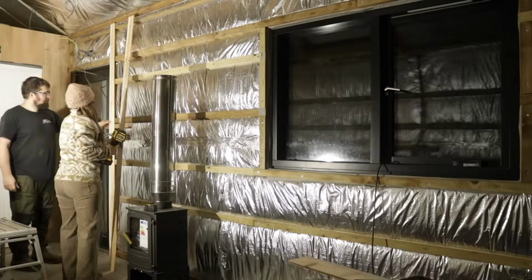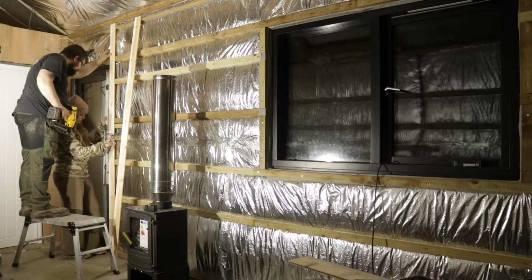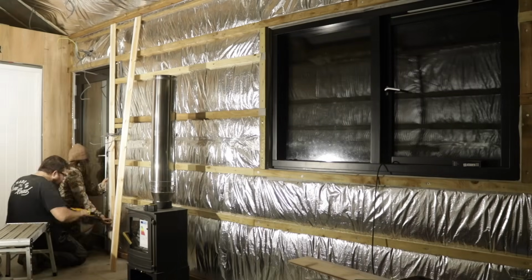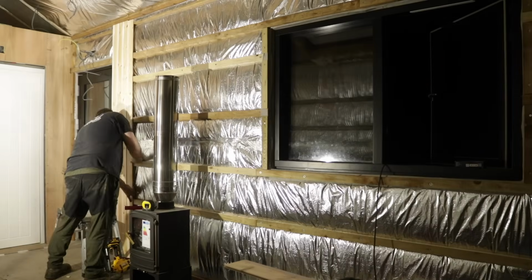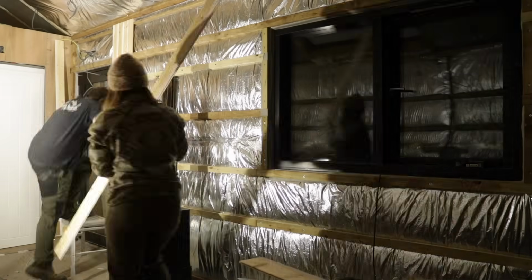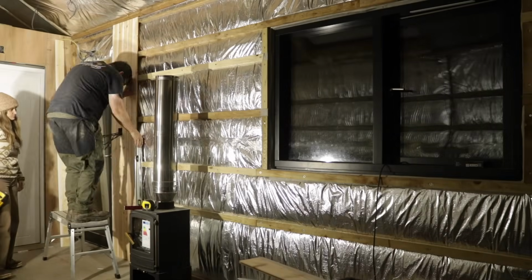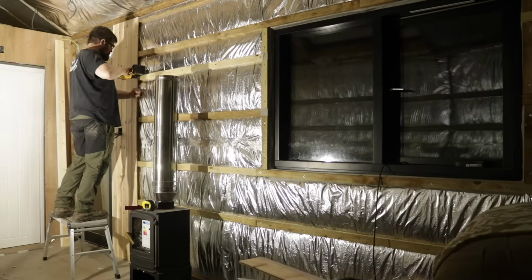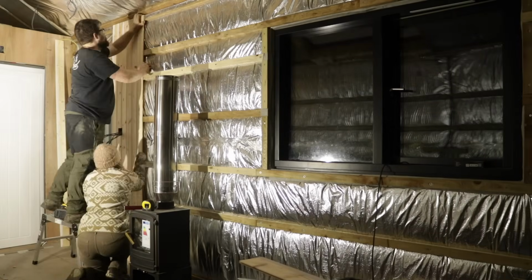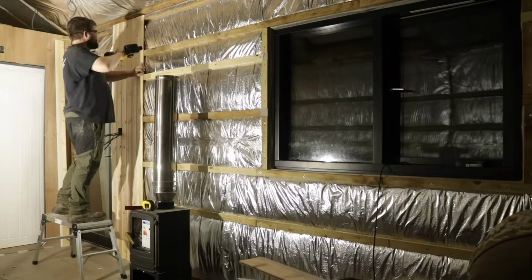While the weather has been nice, we've been working outside and then coming to work inside the cabin in the evenings. This week in the night we started work on the internal cladding, thanks to everyone that gave us advice on the best method for attaching the tongue and groove. We did some tests with our little 18 gauge stapler nailer and it actually left horrible marks in the wood, so we invested in a second fixed nail gun which has 16 gauge nails and seems to hold the boards on a lot stronger. This will come in really useful for future jobs, so we're glad we bought it.